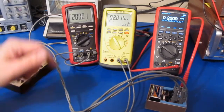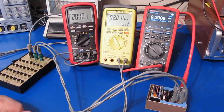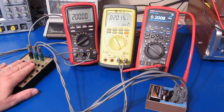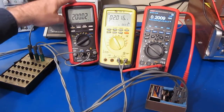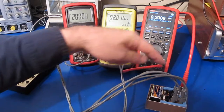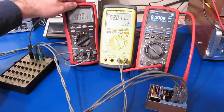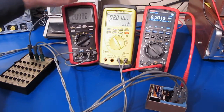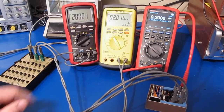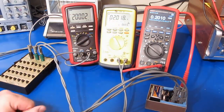The batteries in the TPI meter just died, but now everything is set to go. I have my Fluke calibrator tied in series with a resistive decade box, and that's in series with the Brymen BM869S and our little amplifier circuit. The output of the amplifier is tied into our UT181A. We can see the Brymen is reading 200.02 microamps and our UT181 is reading 201 microamps, with a voltage drop across this of currently 2.018 millivolts.